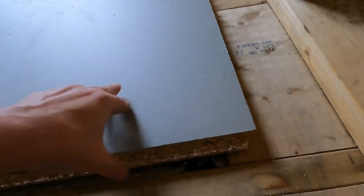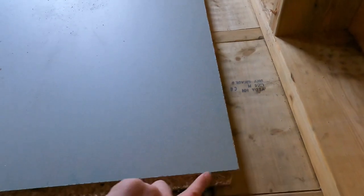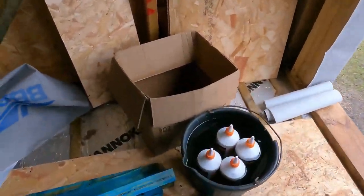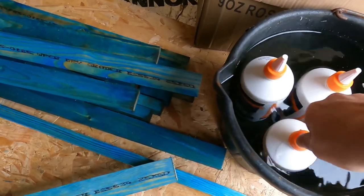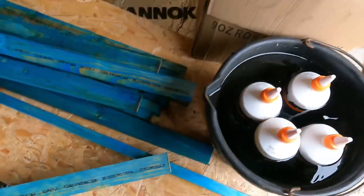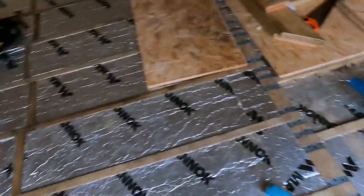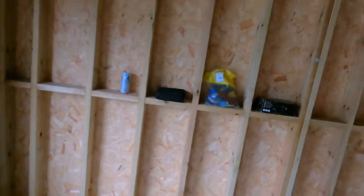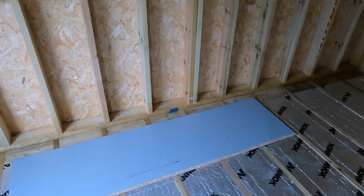Now, on the Cabershield system, you've got a 10mm perimeter going all the way around your floor. And then afterwards you've got to seal all the edges with some D4 Cabershield expanding wood glue, which I'll show you, which is just sat in the bucket here, keeping nice and warm, because it was minus temperatures this morning. Now it's about +5 out there, but with the Cabershield it has to be +5 and above for that glue to work. Even though it's +5 now, that glue pot was probably -2 this morning, so I've put it in a nice warm bucket just to heat up the glue, and then we can get cracking with it.